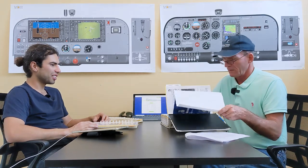Such question is, what kind of engines do we have on the aircraft? We have a Pratt & Whitney 615F engines, which is a dual spool high bypass turbofan engine. It produces 1,450 pounds of thrust. We've got two parameters that we look at to determine the engine output. We have N1 and we have N2.